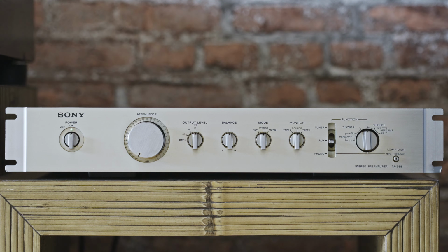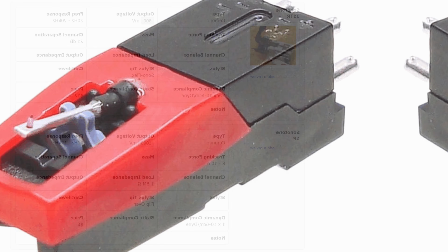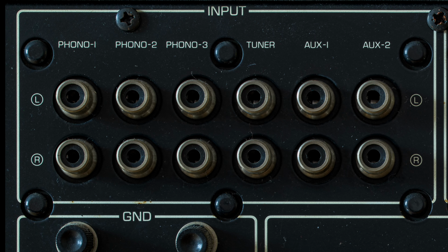And that's why we need preamplifiers. In case of turntables, it's called a Phono preamplifier or head amplifier. Different types of cartridges need different types of amplification. The strongest signal is put out by ceramic cartridges, between 100 and 1000 mV, give or take, so you don't actually need a Phono preamp for ceramics, simple line in usually does the job perfectly fine.